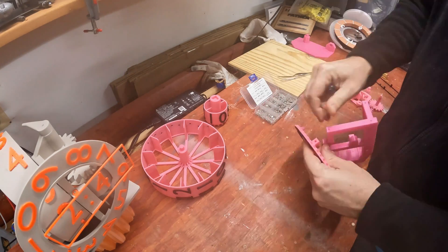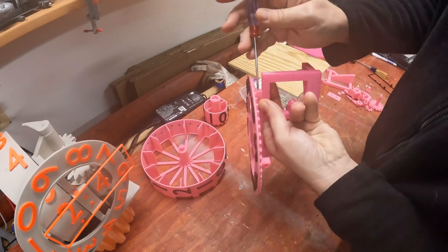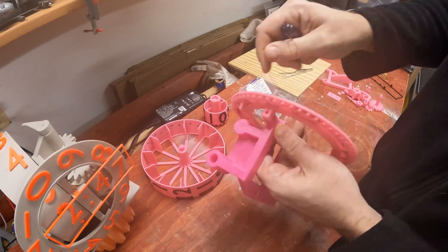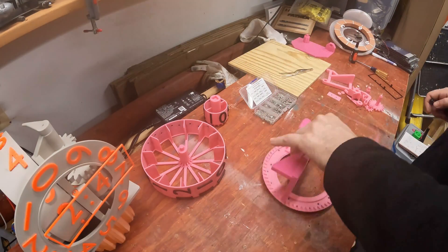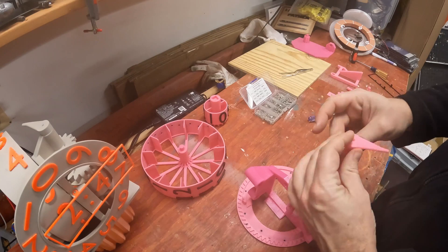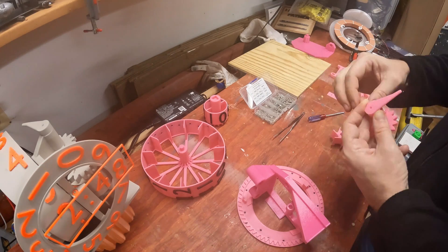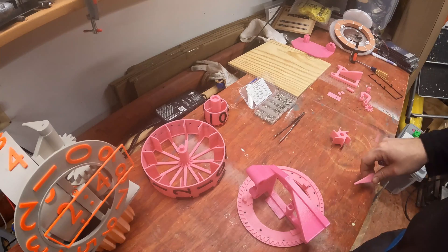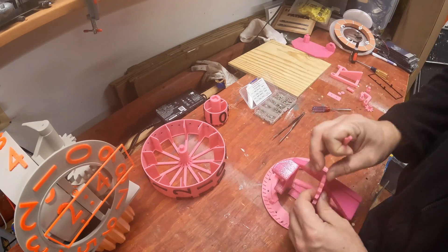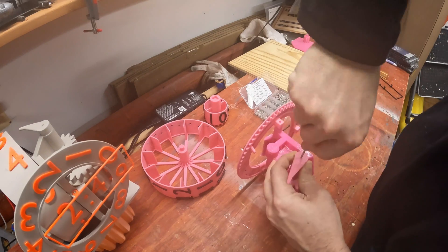First we assemble the minutes digit, which is directly connected to the motor and slides around in this two-part frame. Only attach the top and bottom now; the middle screw also connects to another part of the frame. The minute wheel turns the tens-of-minutes wheel with this pip down here, and eventually this gear turns the hour drum with this arm here. The coolest thing about this clock is that it runs from a single motor, so the motor just needs to turn this dial one-tenth of a rotation every minute. That's why the control can be so simple, but if this is going to be in the makerspace, it needs to be somewhere where it can reset itself and doesn't require any maintenance or fine tuning.